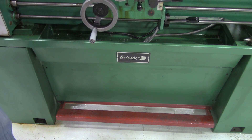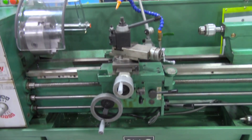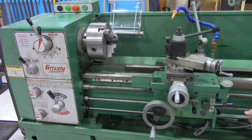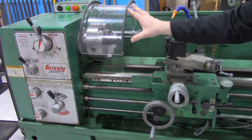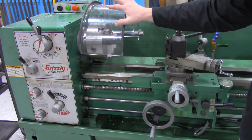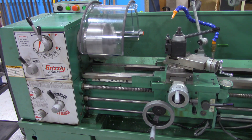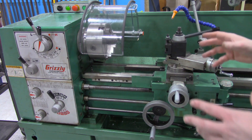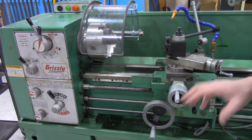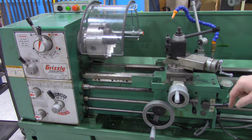The emergency brake does two things: it stops the rotation and it also applies a mechanical brake to the chuck. We're going to demonstrate that. The guard should be over the chuck when you're operating the machine — the chuck guard helps protect against flying chips and serves as a reminder that that's a danger zone. So we'll get it started up and demonstrate — I'm going to step on that brake. Three, two, one. Makes lots of noise and brings the machine to an immediate stop. If anything's wrong, stepping on the emergency stop brake at the bottom is your go-to way of stopping the machine.